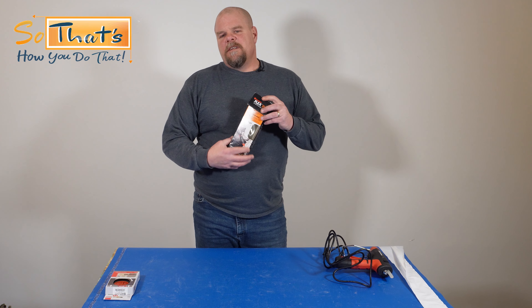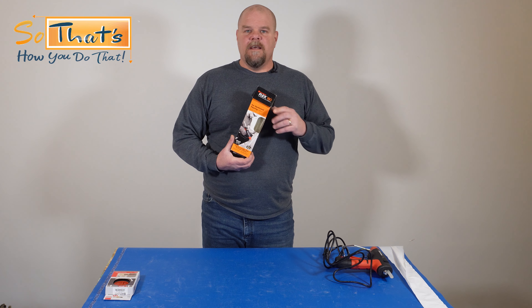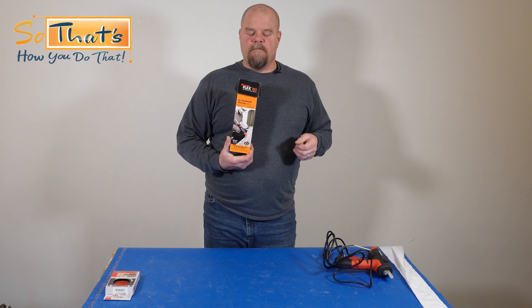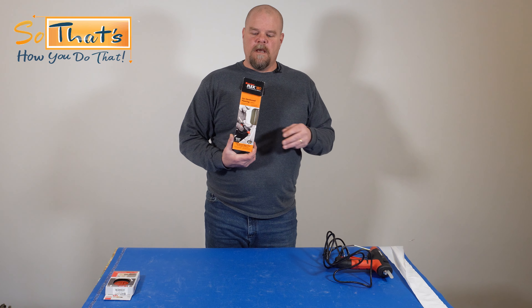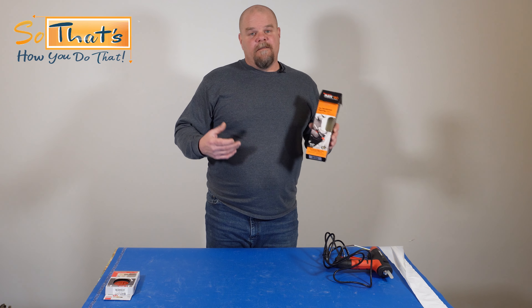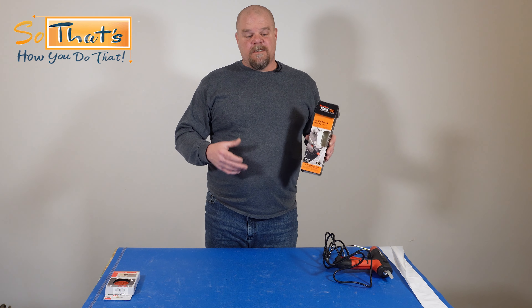Make a little mountain of glue and then take your T-mold, slide it where it needs to go. These bend a little bit so you can bend it to get it underneath, then straighten it out and hold it down. This will also work well for doing stairs — I'm not saying only use this, use another adhesive with it, but this is what's going to tack it down so you don't have to use nails.